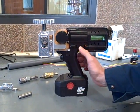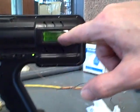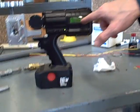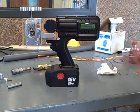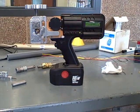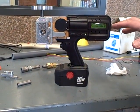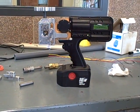Another feature this thing has — notice there's a number here. I'm at number 25, and it tells me the degrees of rotation. It gives me a time and date stamp. Every single action I do in this tool, it archives in its memory — so that was action number 25. I've been playing with this thing this afternoon and I've done 25 different things, including previous cuts, previous swedges, backing off, and going forward. So it maintains an audit trail of actions, and whoever the technician is that did the work with this, all of their actions are stored in memory, which can then be downloaded to a system for archival.